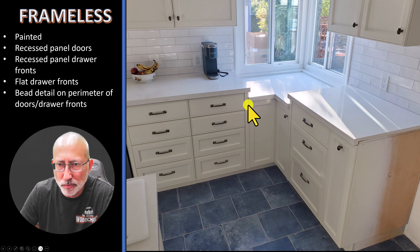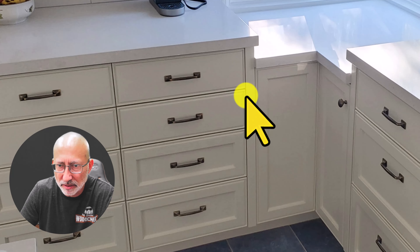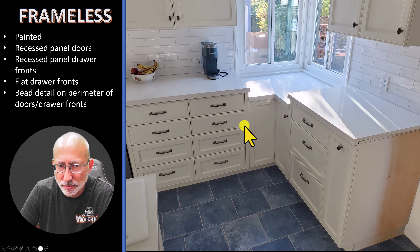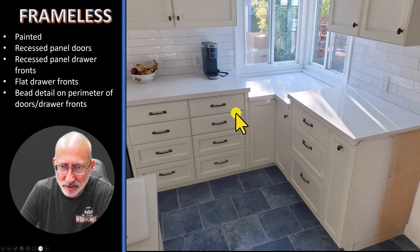Here's another frameless example. I'm trying to show these verticals here. I created a separation for this corner unit because otherwise it would be very hard to have this countertop die into something — the drawer front covers the whole box. So I needed a way to make a separation point. I think visually it looks good too. This brings me back to when I was talking about making frameless look inset — here, exactly, it looks inset because of that frame piece.